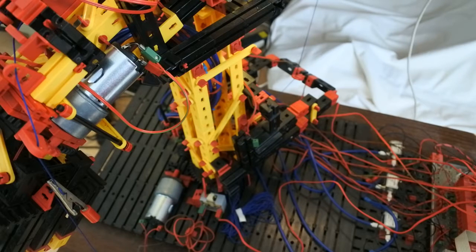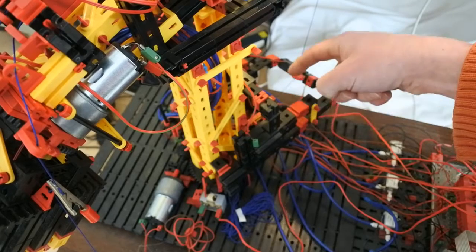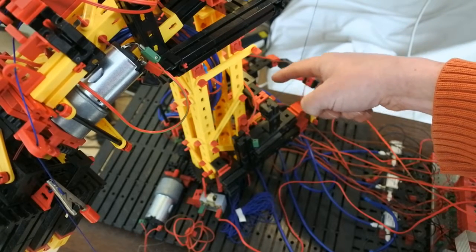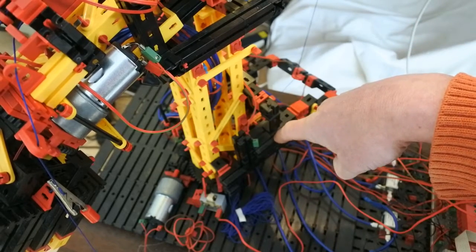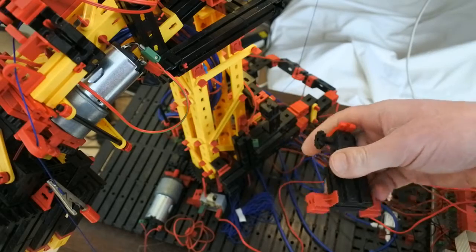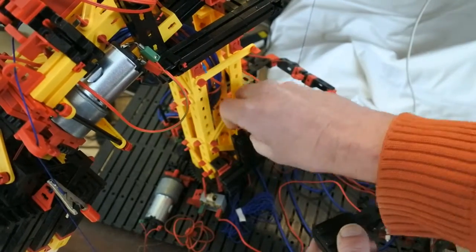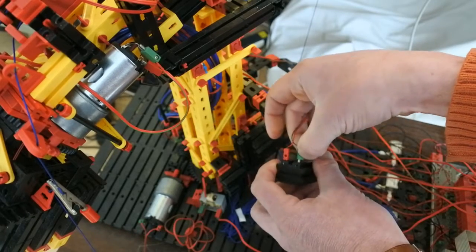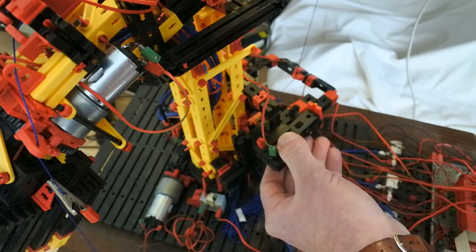I did check the wiring and that seemed okay, but when I start with the interface once again, it looks a bit like this gear works in one way, but it could very well be that it is drawn and dragged by the other one. So to be absolutely certain that this motor is working anyway, I'm taking this motor and switching wires. And then it should be very clear if the motor is correct or that I maybe have to change the wires. So let's do it again.